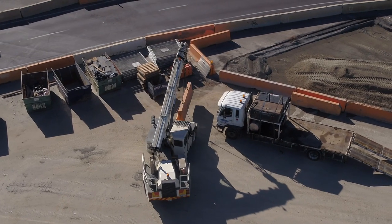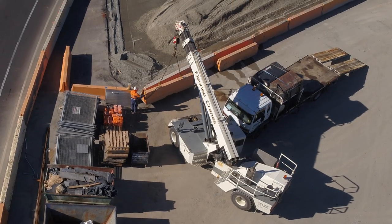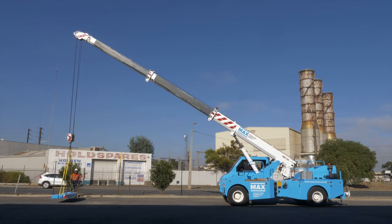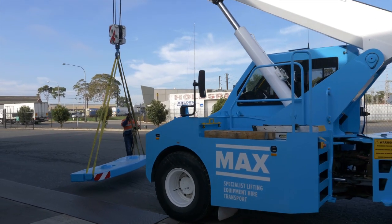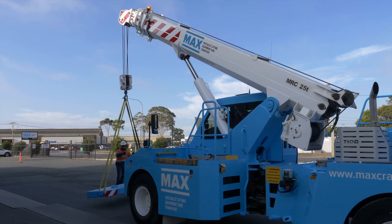But things change when the crane is slewed. Side loads now become an issue as the crane's tipping line changes. Note how the center of gravity of the rear section is now very close to the tipping line, and note the position of the center of gravity of the lifted load relative to the tipping line. If the boom was to be extended further, the center of gravity of the load would move further away from the tipping line, increasing further the risk of a turnover. This is why manufacturers always recommend that when travelling, always do so with the shortest boom possible.